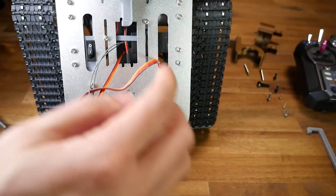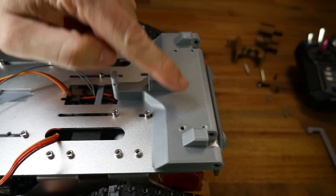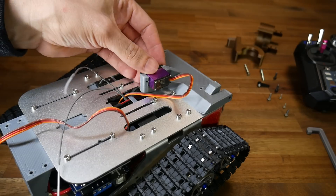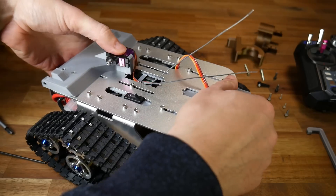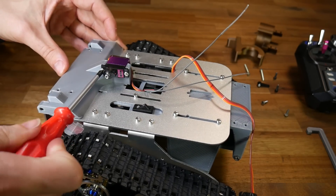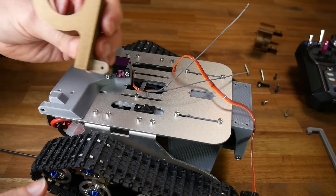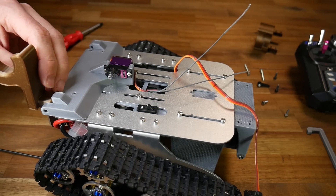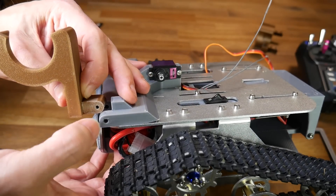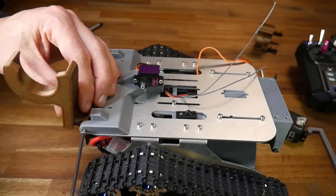Take care to thread your two servos through to the other side, because we're going to attach those next. The upper mount has been bolted in from underneath using the holes that line up with the rear of the tank chassis. Now we're working on top — we're going to take the smaller of the two servos and bolt it in place on the center of the upper mount, facing the right hand wheel. Your servo should have come with two small self-tapping screws, and the boss for mounting is designed for those to grab and hold the servo in place. The output of the servo goes towards the back of the tank. Next, we're going to install the two can holders, and it's very important that they're able to swivel up and down freely. We're relying on gravity, so if you need to do a little bit of sanding to make sure it moves freely, do so before inserting any bolts. The hole in the can mount is three millimeters, and the other ones are purposely too big — we want the bolt to pass freely through the silver parts but thread inside the gold ones. That will be plenty secure.